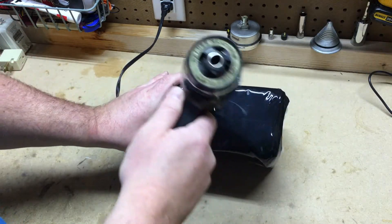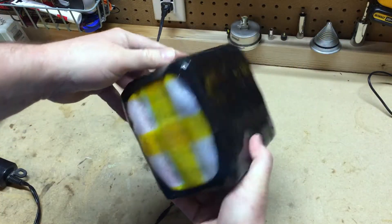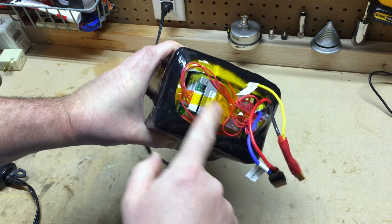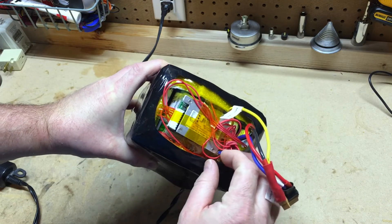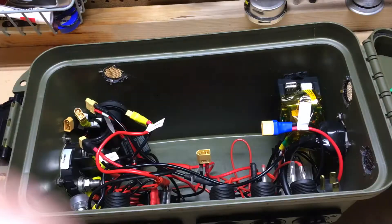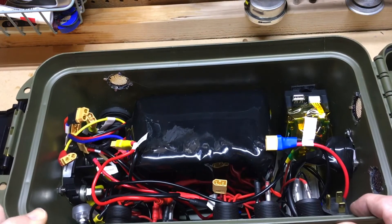As I finish up the battery here, everything is smooth and tight, and I'm very happy with how the shrink wrap applied to the battery. I'm going to keep the top and bottom of the battery open and not put any more shrink wrap on that. On the BMS side, I want to be able to access the wires and the on/off switches. For the bottom of the battery, I'm thinking I'll just leave it open for better airflow and circulation. Inserting the battery now goes in nice and smooth with all that plastic — everything is snug and tight and working really well.